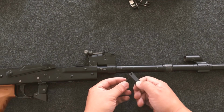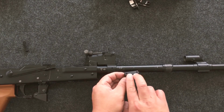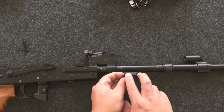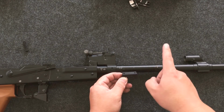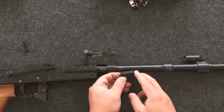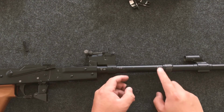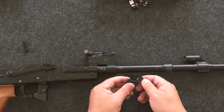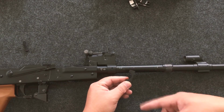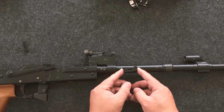So with the number 8s, the holes here are actually spaced out a little bit more than the original design, but they're still close enough that they'll clear the holes in the heat shield. So no modifications to the holes on the heat shield. And by placing them further apart, I can actually clear the barrel with the number 8 fasteners completely, so I don't have to tighten one side more than the other. I can just go whatever way I want and get these on.